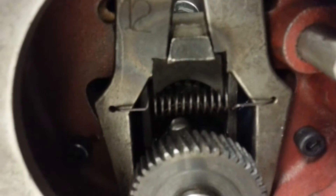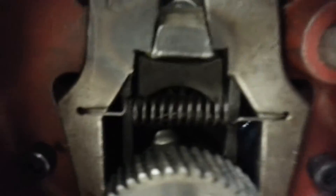You've got to make sure the de-clutch keys are different lengths. You can see why they would sit on that shoulder — if they were the same length, they would just go back and forth.